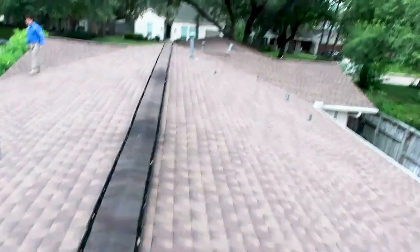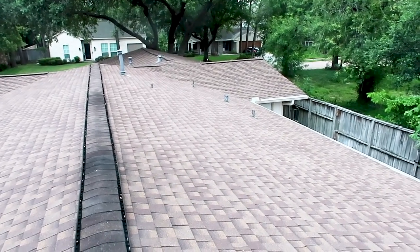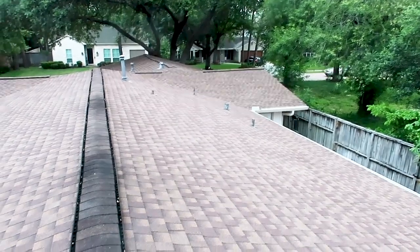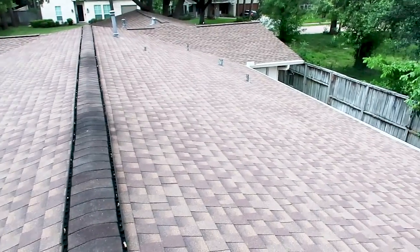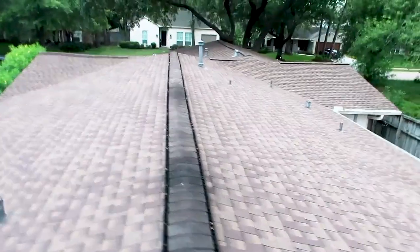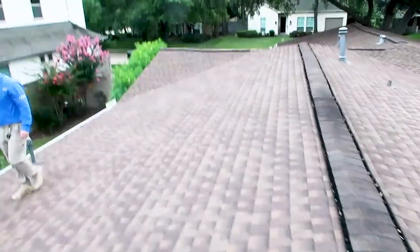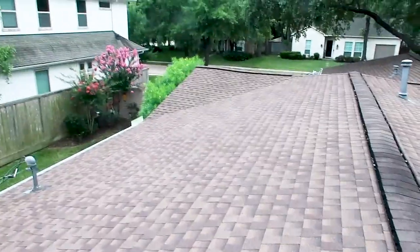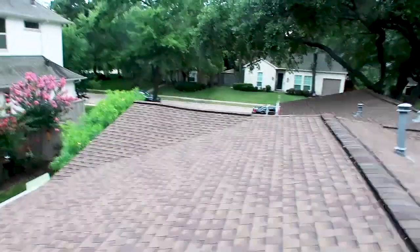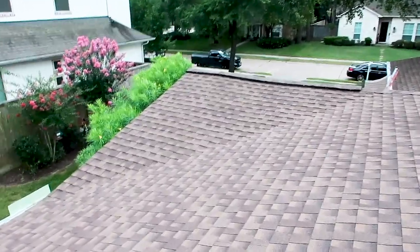Tyler noticed along the ridge lines there's a hump way over there on the back roof, and you can see some pitting here. Doesn't mean it's bad — it's just something we need to pay attention to when we get in the attic space to make sure it's properly supported with purlins. And then there's a tree touching the roof. You definitely want to bring that down because it damages the shingles and also invites carpenter ants and wood-destroying insects into your property.